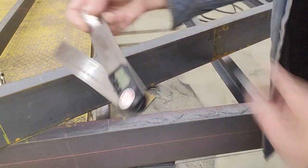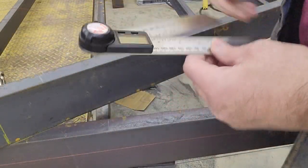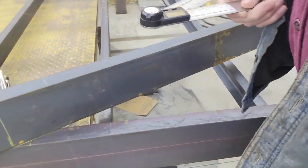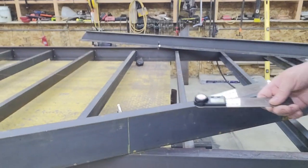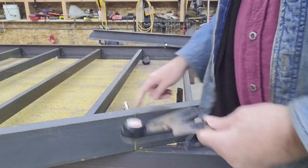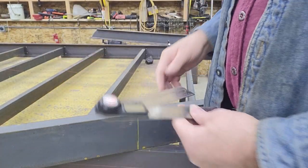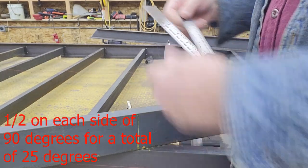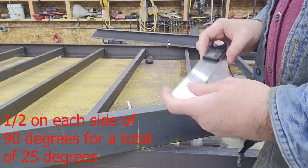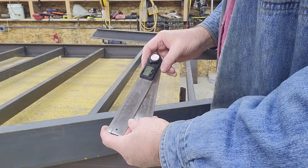And you don't get much closer than that — 25.1 degrees. What we didn't do with that measurement is that's the total angle. So when I cut out the pie piece to allow this leg to fold over, I need half of that — 12.5 degrees is what I want. So I can just fold the protractor around until I have the 12.5 degrees.